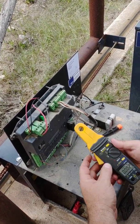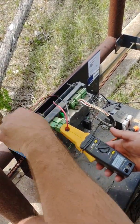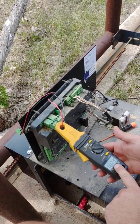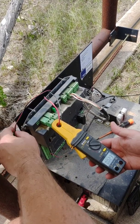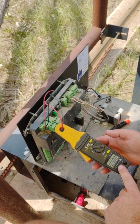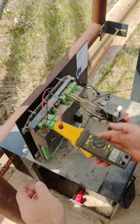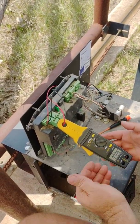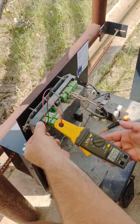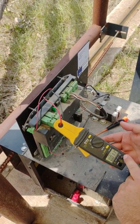Press the hold button and clamp it on to your main feed to your board. Unplug the solar panel connection, then turn off the hold. The board's using about 20 milliamps. While you're reading that, plug in the solar panel — see, it went to a negative amperage reading. That means it's pumping 500 to 700 milliamps out into the battery from the solar panel. So the charger's doing its job, the solar panel's doing its job — that's what you want to see. If you unplug the solar panel connection, it goes to a positive power draw again.